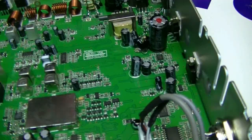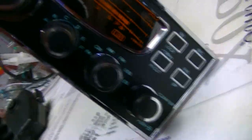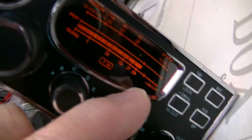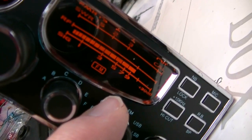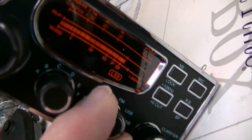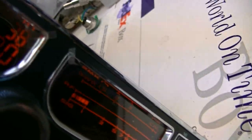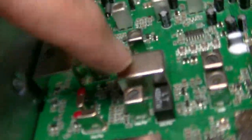There are your dual filters. Let me show you — switching to internal on channel 38. I've got an S9. Now those dual filters only come into play on AM, so let me switch to AM. There's AM right there, there's FM. You don't lose any signal with the dual filters — it just narrows your bandwidth, which decreases bleed-over. But that only applies on AM and FM. Sideband doesn't use that series of filters; sideband uses this big filter here.